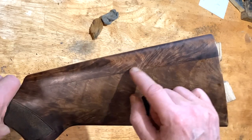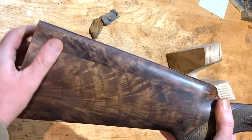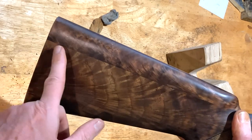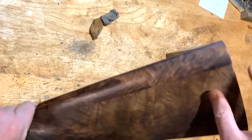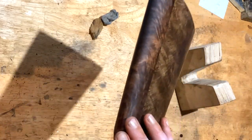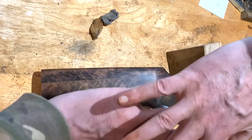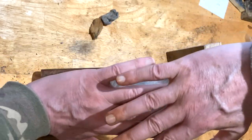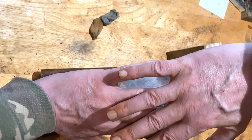So those grains are running that way, these grains are running that way. So there's automatically a clash. And where grain is pushing away, on this it'll be pushing forward. So I'll get dark stains here when I add more stain. And it'll be dark here and light here, because the two grains are in opposition to each other, if you imagine an invisible situation. If all the lignin in the wood was invisible, that's what you'd see with the fibres.